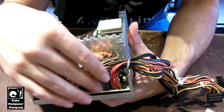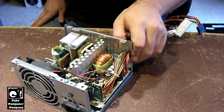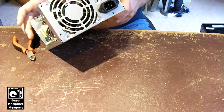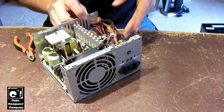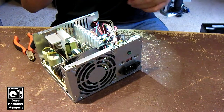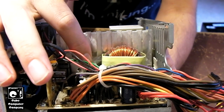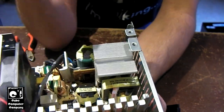Let me get a look at what capacitors we have in this unit. I've got to go ahead and cut some zip ties and gain access to some things. I want to see what values of capacitors we have in here, because I may not have every single value — in that case I'll be doing a partial recap. We definitely want to replace the capacitors that are bulging, because those are obviously the ones that are failing. The one that has failed is a 2200 microfarad 10 volt capacitor — I definitely have those. I also got another 2200 10 volt cap over here which is fine, at least visually.